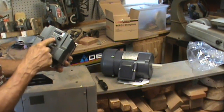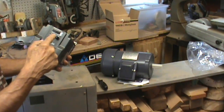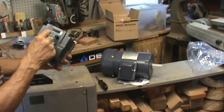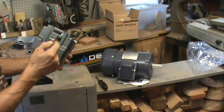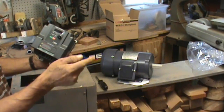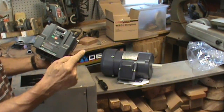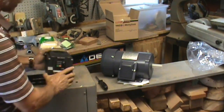You got to go to that function, change the parameters on it, and the motor would reverse. You want to go forward again, you'd go back into this, to that function, change the function number that shows up on the dial, change it to, let's say, a 000, then the motor would go back again in the opposite direction. I like the idea of a toggle switch, forward, reverse, off in the center. That's what I use on my Atlas.